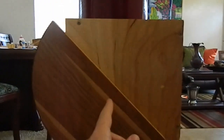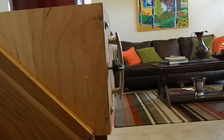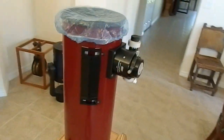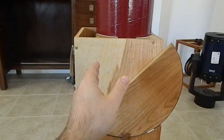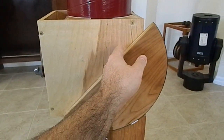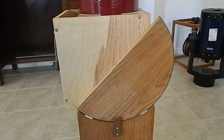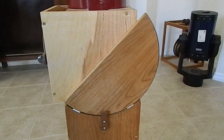I aligned the tube's center with the center of the bearing, but I think that was a mistake, because you're always going to have more weight to one side of the telescope. You have the handle, some items that add a bit of counterweight, plus you want the focuser at a 45-degree angle, and you'll also have the Telrad over there. So next time I'm going to locate the cradle a bit offset from the center of the bearing to better balance everything. It was a good learning experience.